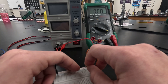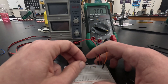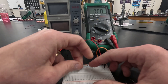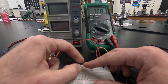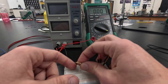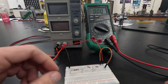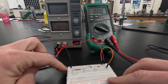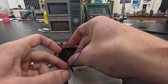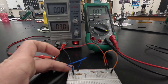I get to pick where the second leg goes, so I'm going to put it into row 13 — that's where my 100 ohm resistor goes. Next I'll add my 220: I'll go where I ended my last one, which was row 13, place it in any hole in row 13, and then go down to row 20. Then finally the 330: I'll place it in row 20 and then go down to row 28. From there I need to continue the electricity flow back to the negative end, so my blue jumper wire goes in row 28 and jumps back to the power supply negative. That's our breadboard setup.